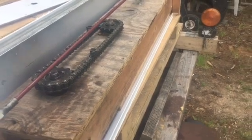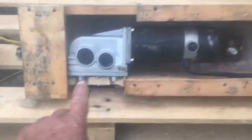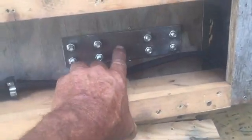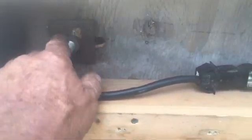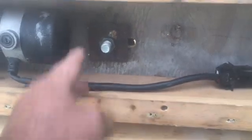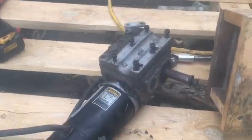Here's the back side of it. All this really is is a 24-volt motor off of a wheelchair. I used a quick-connect plug and just welded a bracket on that end of the pipe for this demonstration — yours would be hanging on the pump coming up out of the well. I cut a notch that lets the idler pulley slide up and down — I'll show you a better view of that on the other side. We put a couple little screws in it for tighteners.